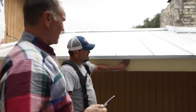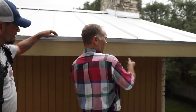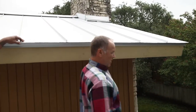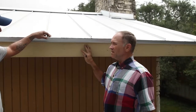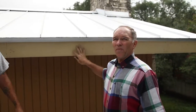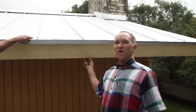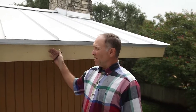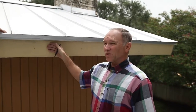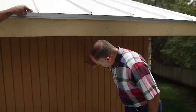This is a skin — it's a fiber cement skin. It's the same thing as the hardy siding but it's going right on top of the fascia. And now this will all be rot-proof. We don't have to worry about this continuing to deteriorate anymore — it will not deteriorate anymore. And the paint will stick way better than it has to the siding in the past. It's required repeated paintings over the years and it still isn't preventing rot because it absorbs moisture from the bottom and from other places.